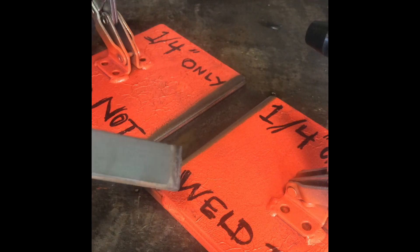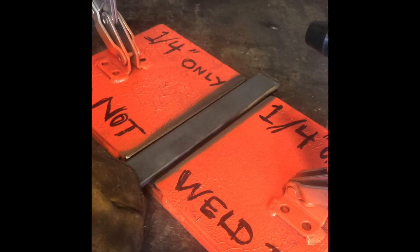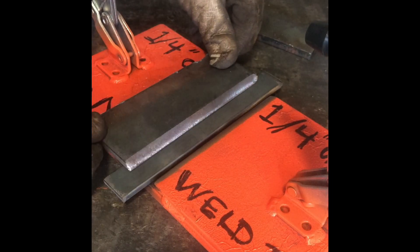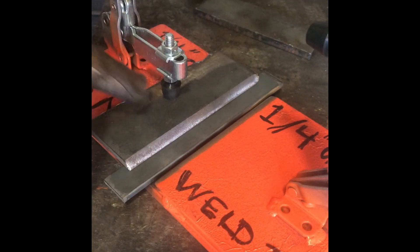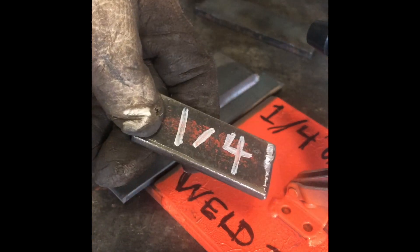For a quarter-inch backstrip, which we're using here — a quarter by one by seven or eight — you lay it down in the middle. It is made for that. You're going to put your first piece down, try to center it up. Bring your switch down, your latch, push it, it'll lock in tight. We're going to be using a quarter-inch spacing. Get your gap tool ready.